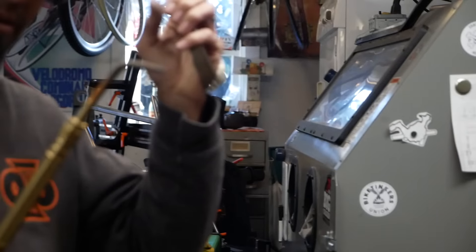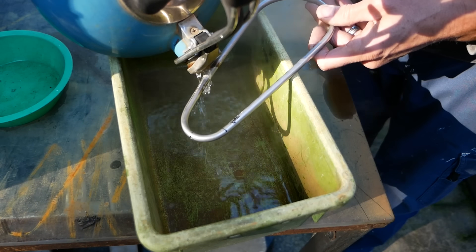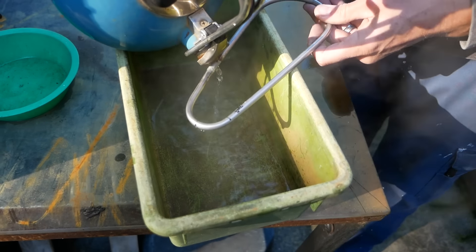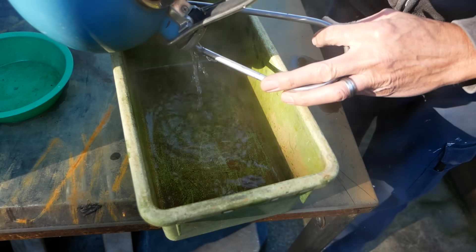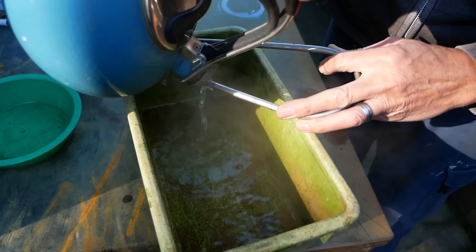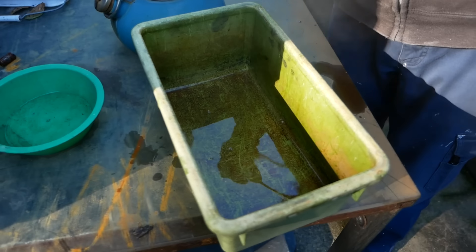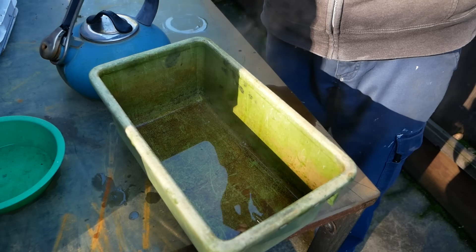With silver too you can tap it - it flows - then pull the heat off real quick and it'll kind of melt to where you want it to. So you don't need to brush it off or anything, it just melts off. I was spending hours filing it all off but I wasn't using hot enough water. When they said hot water they meant boiling hot water - I was just using lukewarm tap water.